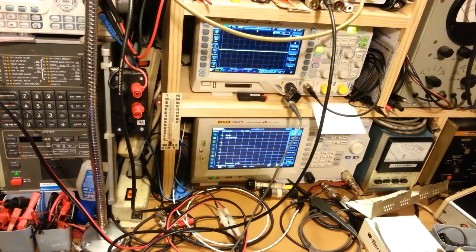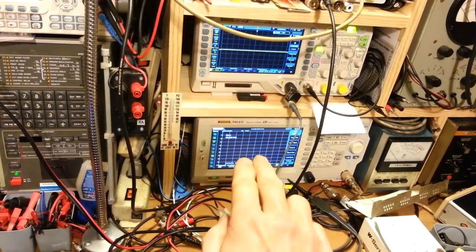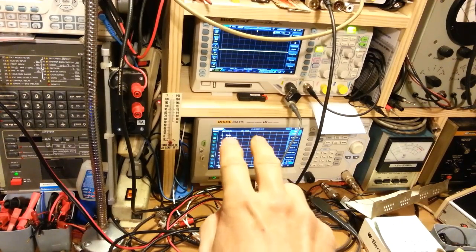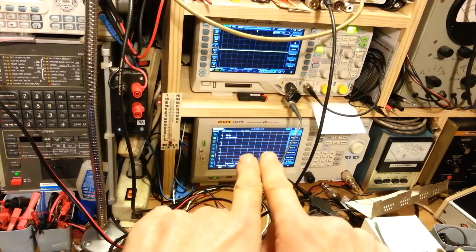And I just knocked the oscilloscope probe off of the coax connector again. Get that hooked back up. Okay, it's on again. So that's, like I say, 5 channels. So what you want to see if you want a good working radio is basically a peak right there in the center. But as the frequency changes, you'll see the 2 side bands, because we're going to be transmitting in AM. And you have to remember, AM has 2 side bands.